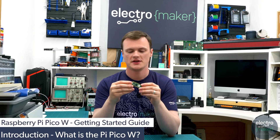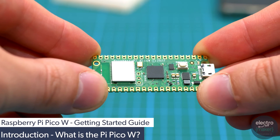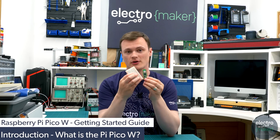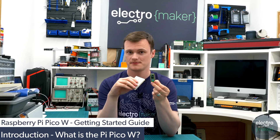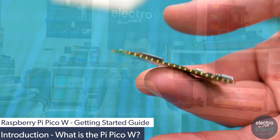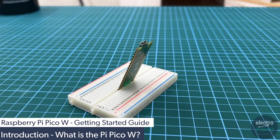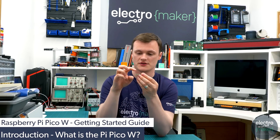With regards to hardware, just like the Pico, the Pico W has a micro USB connector for programming and communication. It has all the GPIO on the outside in two dual lines, making it compatible with breadboards which are extremely maker friendly. You can solder pin headers onto it, plug it into a breadboard, and reuse the same Pico W across multiple projects. It also has the same mounting holes in the same positions so it will still fit in enclosures for the Pico. And while the Wi-Fi module does stand tall off the PCB, it's actually shallower than the micro USB connector, meaning it will fit in the same enclosures as the Pico.